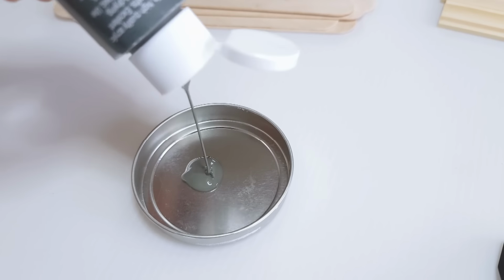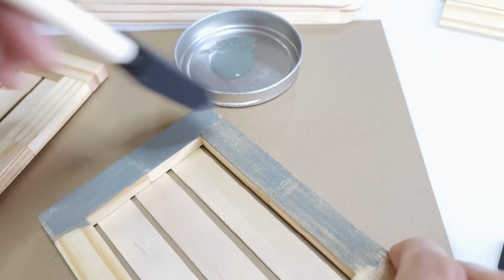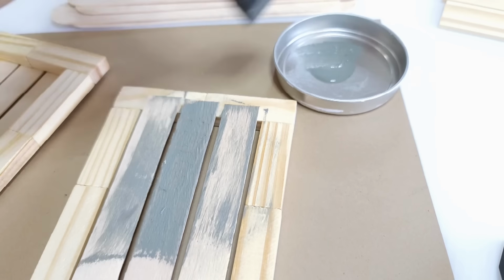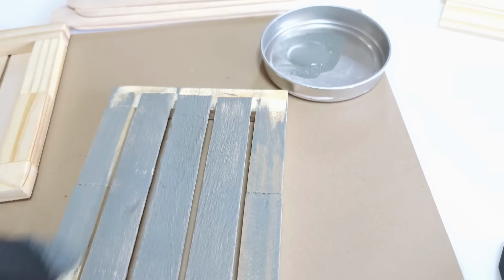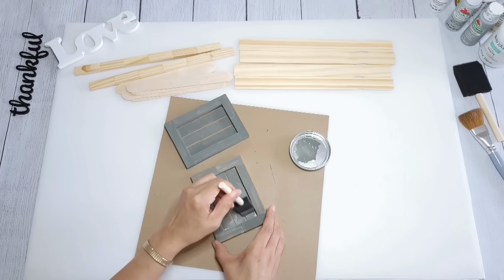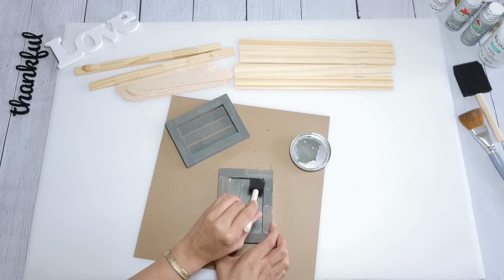I'm going to paint the wooden frames ahead of the other surfaces that will also need to be painted once the piece is complete, because these are going to be glued directly onto a gray store-bought frame, and I don't want to get any paint on that. Otherwise, I would have painted everything when completed.